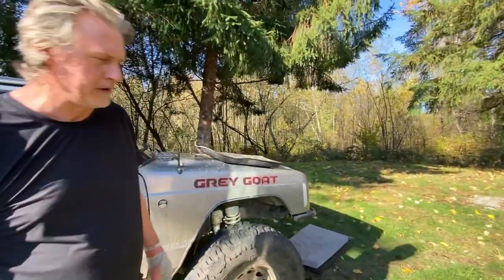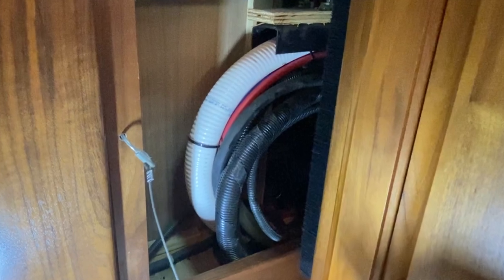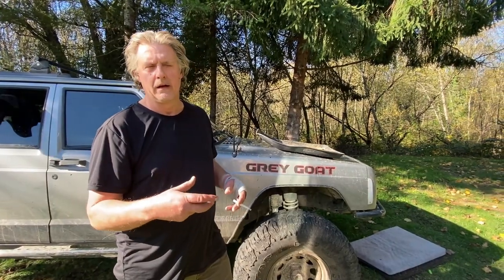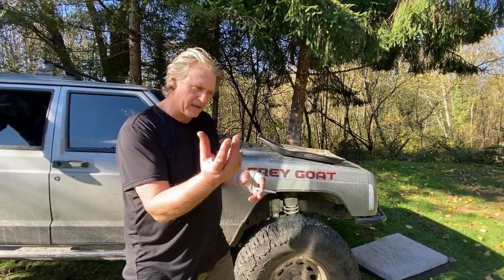And it looks like what the previous owners did is when the slide comes in, there's a hard ABS pipe. It goes to a flexible white pipe like PVC, and it's supposed to roll on this slide, and it rolls in. And they had all the other electrical looms, everything zip tied to it, so it choked it so it couldn't roll down.